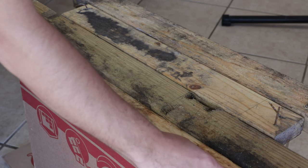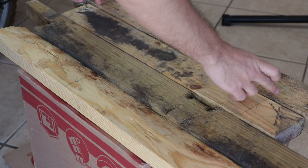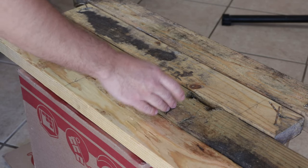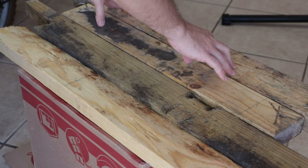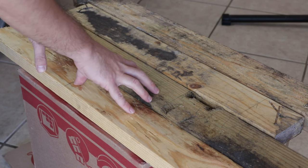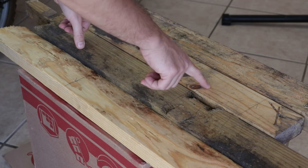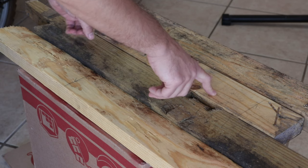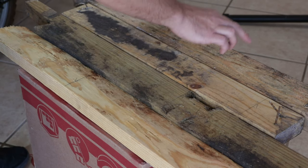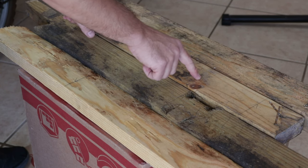What I need is a 16-inch piece, another 16-inch piece, a 20.5-inch piece, and another 20.5-inch piece. I've already marked my cuts, except for one piece — these ends can be shorter or longer, it doesn't matter much. This one can be 20.5 or 21, it can't be too small but it can be slightly too big. The important thing is the second lengthwise piece needs to be pretty much exactly the same as the first.